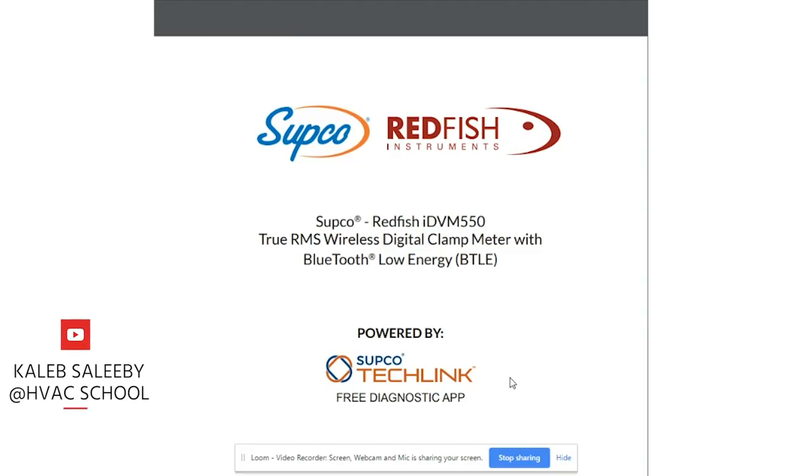Checking capacitors under load using the power factor feature of the meter in order to determine whether the capacitor is at rated capacitance or not. This has come in handy a lot, especially because there are certain manufacturers who have manufactured fan coil systems with the capacitor for the blower motor mounted on the blower assembly, tucked all the way back into the cabinet. The only way you can get to it is to take the blower assembly out of the cabinet itself — it's a pain, and it adds extra time to maintenances. So this has been a pretty interesting and valid measurement to take, and it's been very helpful.